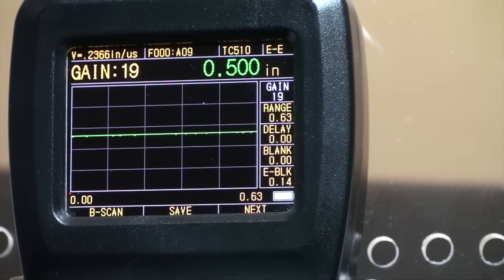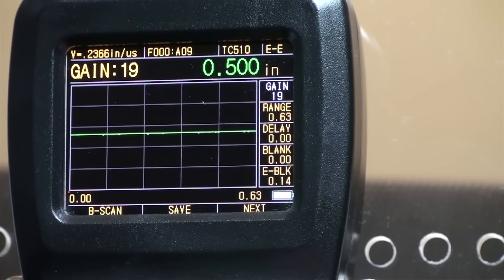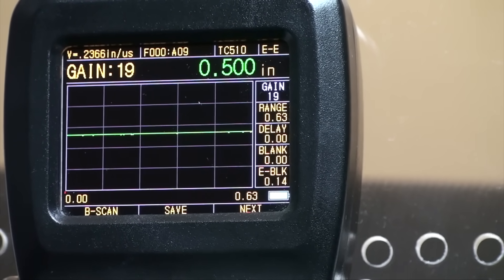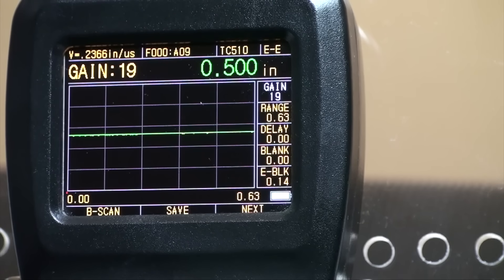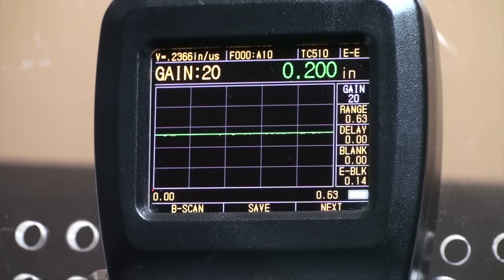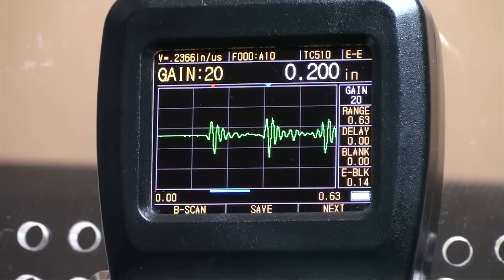The gain adjusts the sensitivity of the gauge with the unit decibel. The larger the gain is, the higher the sensitivity is. The gain ranges from 8 to 55 decibels. When testing flat parts, the gain should be low. Aluminum and cast aluminum should also use low gain. Steel and stainless steel should be in the middle. Steel cast iron pipe should use maximum gain. When in echo-to-echo mode, the red arrow on the screen should point to the first wave and the blue arrow should point to the second wave — this tells you that you have the gain set correctly. In standard mode, only the red arrow will show.